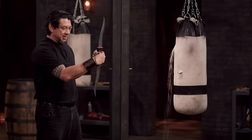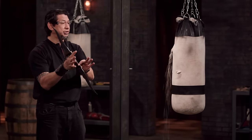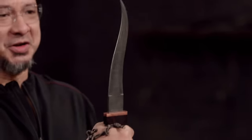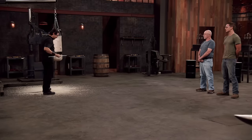Okay, Ray. I like the design of your blade. It feels good in the hand. You got that ovoid shape for the handle, and I like also how it flares over there so it stops for the thrust. I love your recurve and Damascus pattern that you have on both ends of your blade. It's very dramatic, and it looks good. The belly of your blade slashed nicely on the canvas, and it allowed for a good thrust. And this blade will cut. Good job. Thank you. Steven, you're up next.